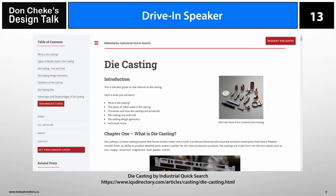It's not my intention to go into the actual process of die-casting, as it's a very in-depth topic, but there's a lot of good information out there about it. When I first thought about using the drive-in speaker, I assumed it would be zinc die-cast, but both restoration videos said what they found was aluminum. When I was active in manufacturing, our main focus was plastic and aluminum extrusions, but we occasionally had smaller parts die-cast - in that case we almost always specified zinc for tool and part longevity.